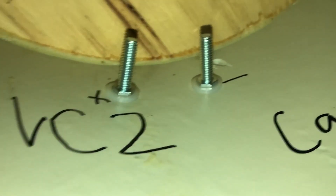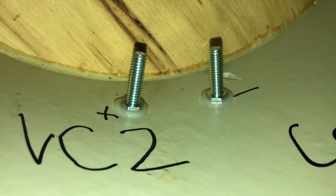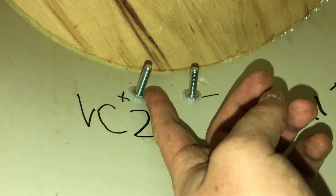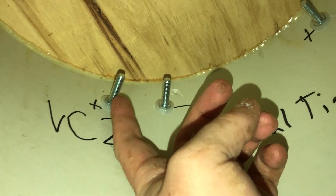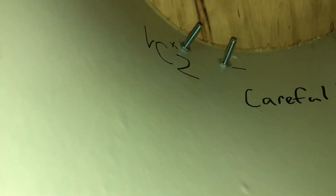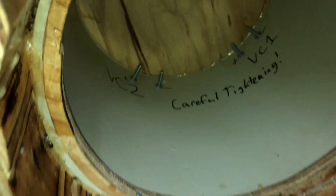The way I did these is those two things behind them are nylon washers. I've got the nut on here. So it'll go: nut, then probably a washer, then another ring terminal going to the speaker power cable, then another nut. So these are sandwiched in. And on the other side there's another nylon washer, then the eyelet, then a brass washer, then the bolt.